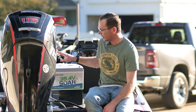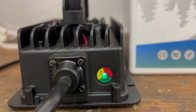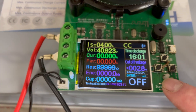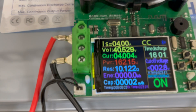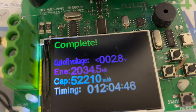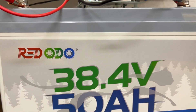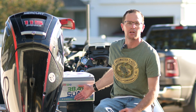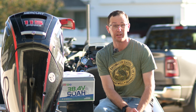Let's talk about performance. It is rated at 50 amp hours. I did a capacity test on it — fully charged up, let those cells balance, and pulled just over 52 amp hours out of it. So you're getting the full amount it states, which is great. Any degradation down the road, you're already starting ahead at 52 amp hours, which is fantastic.